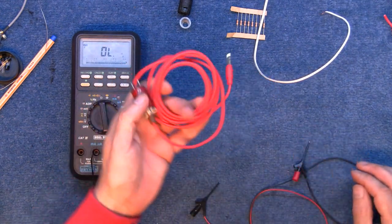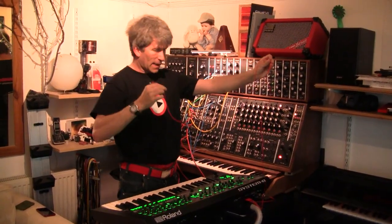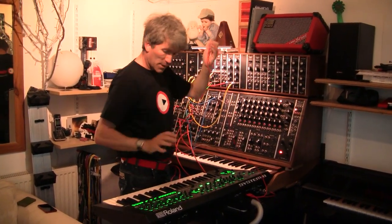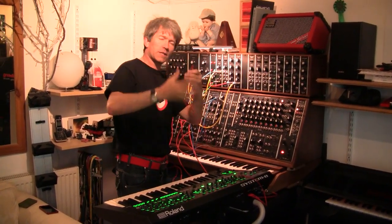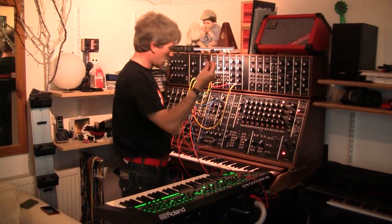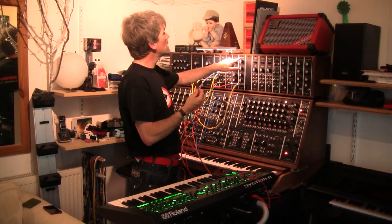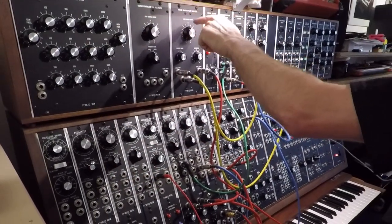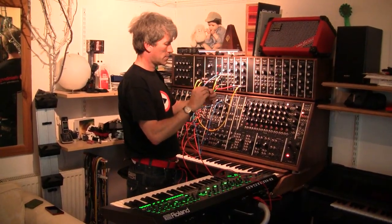I'll go and plug it into the synthesizer now and see how it works. So there you go, the cable's all made up now, and this end's plugged into the gate output. So when you press a key, 5 volts will come up here into the circuitry, and that will change it to an s-trig, which is shorting trigger, I guess. Anyway, this end, I'm going to plug it into a 2-into-1 Cinch Jones cable here, because I'm going to set off two envelope generators. One of them's going into the voltage controlled low pass filter, and the other one's going to go into the VCA, I hope.